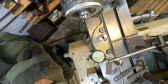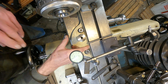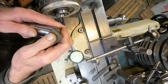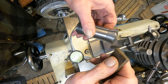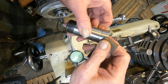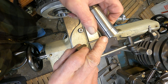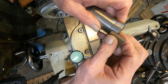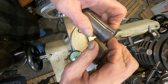Since it's an old collet, let me make sure you can see. I've actually done this a couple of times because I've been flubbing up the videos with my crappy equipment, and it's getting better. I'm taking an Arkansas stone and just knocking the burrs off where it mounts — you can feel them and you can see them. I'm stoning where that thing contacts most, and this is good for your holding devices too — make sure you're not sticking a collet in there with burrs on it.